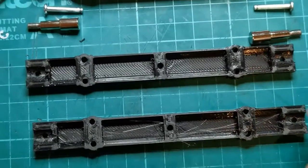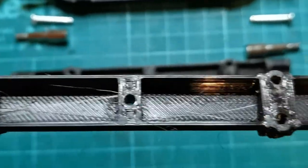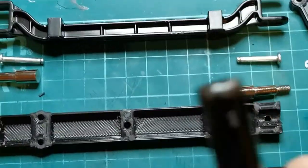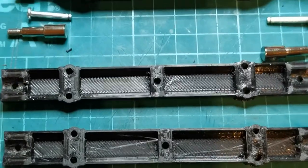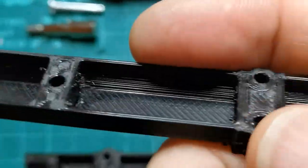As a little side note: if you ever want to get rid of these little stringing effects in your prints, just get yourself a candle lighter like one of these and just run the flame inside here. Run the flame around and the flame will just take off all the wispy bits, rather than you having to try and remove them manually.